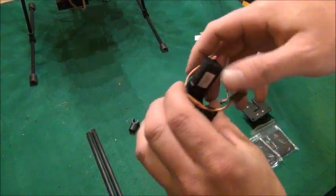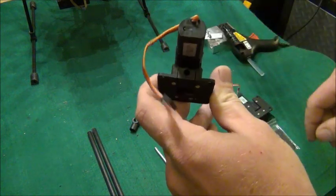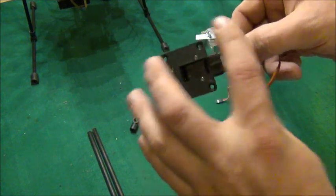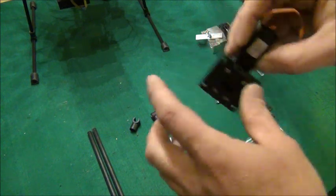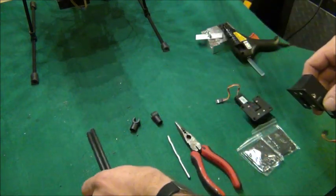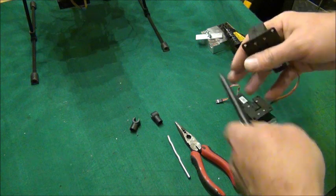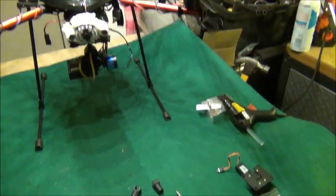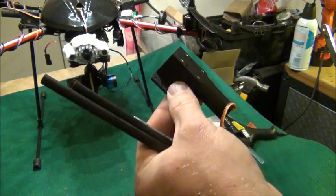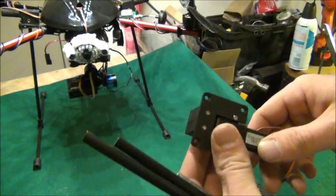The first thing you want is some retracts from HobbyKing. These are from the China warehouse and they have a smaller version available in the US warehouse. The retract is one piece, self-contained, and it has a five millimeter hole for the retract gear wire. I'm using these carbon tubes — this isn't carbon fiber, it's just the cheaper carbon stuff. On mine I put the taller ones, but this would work for something like a Phantom. I'll put the link below — this one holds four pounds a piece, which is plenty for my quadcopter.